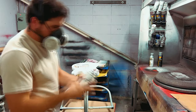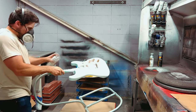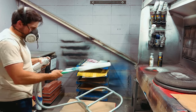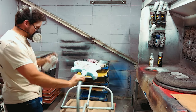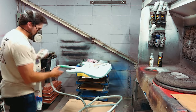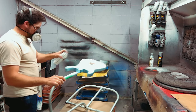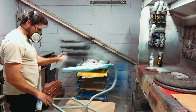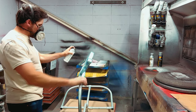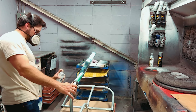You'll notice I need to shake this one really well too, although there's not as much particulate matter — not as high solids as those primers — but you want to get your metallics mixed up really nicely. I'm again doing the horns and edges first. I start with the horns because of the way I spray them — it's kind of in smaller bursts — then I can make my way around the edges more smoothly. The spin twist spray rig makes things a lot easier; you can see how much smoother that goes. I do that from one side and then the other, which gives me good coverage on the first coat.